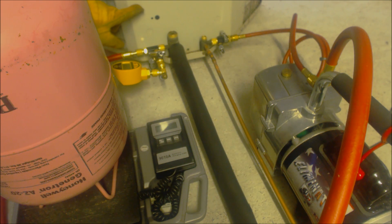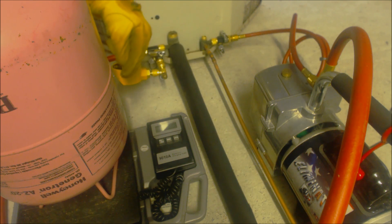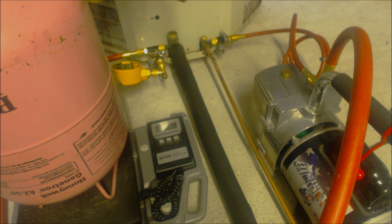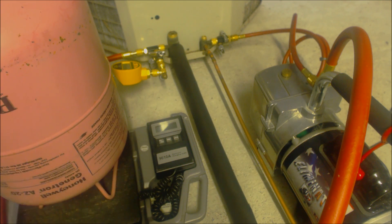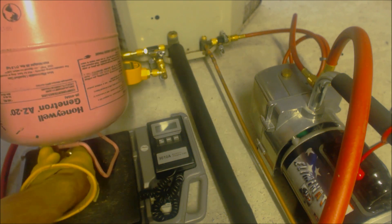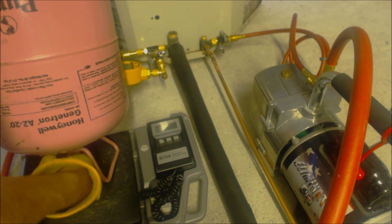You're going to look at the rating plate on the unit to see how much refrigerant it's calling for. Most units come with enough refrigerant for the evaporator coil and 15 feet of line set, so any additional line set you'll have to add that refrigerant as well, or you can do that when you're actually charging the system when it's on. This unit is calling for R-410A refrigerant. I'm only going to weigh about a pound in. You can weigh anywhere from a pound or 14 pounds, whatever you need, just as long as you weigh it in as liquid into the liquid line and you are under a deep vacuum. If you try to put it in as vapor, you're not going to get very much in — you might get 8 to 10 ounces and that's about it. Now we're going to go ahead and add our refrigerant.